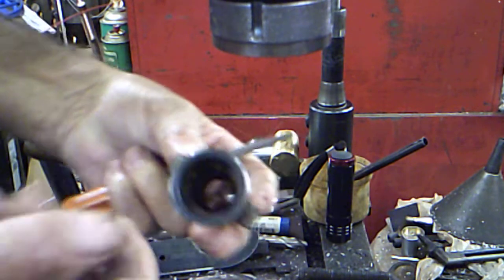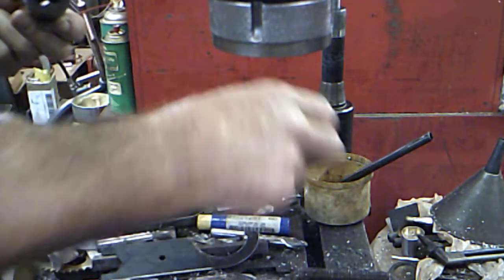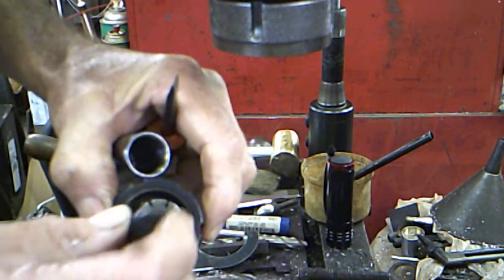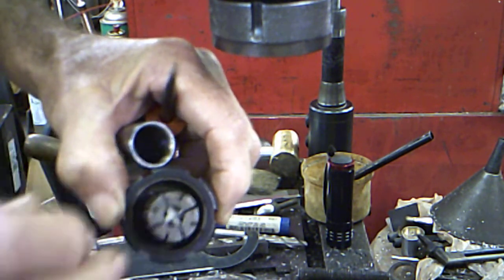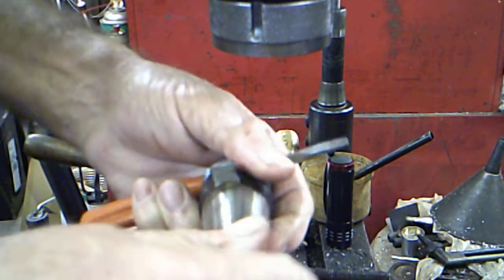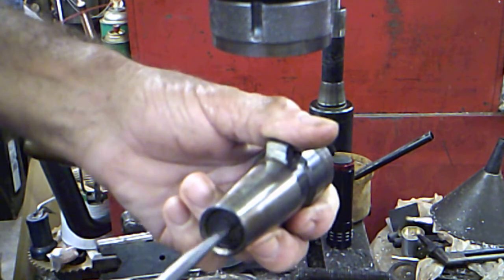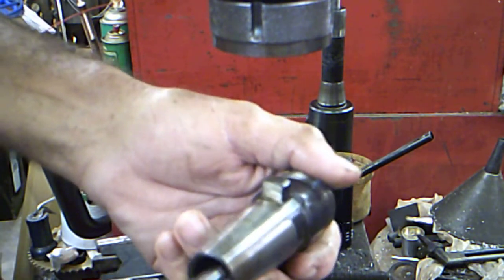Can you see down inside there? The collet — so it was sitting there, and then when the collet for the end mill went in, the collet was touching like this. But it was holding by one thread, and it was stopping this from getting up inside of here and tightening up like it should. For whatever reason this thing is left-handed. I don't know if this is some form of a stop, which seems kind of silly because if you use a double-ended mill, it's going to be a problem — you're going to be smashing your flutes into the stop.